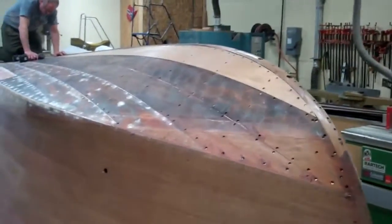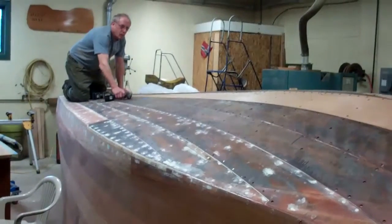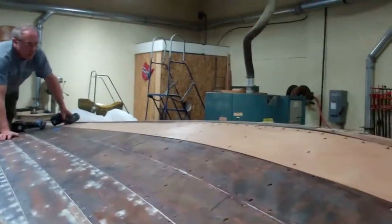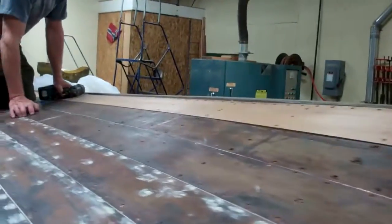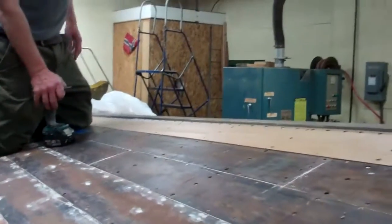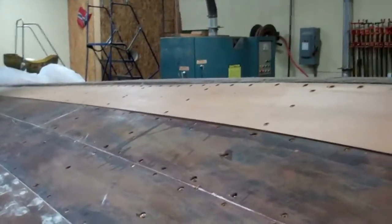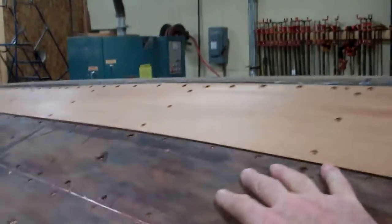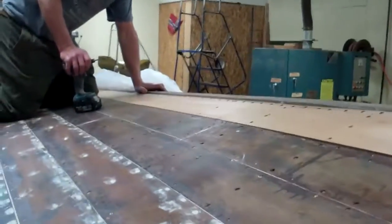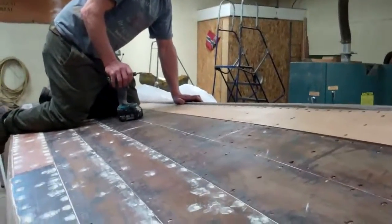We're working on the board we were looking for — the keel plank. If you'll remember from the previous clip, this plank was the forward section, which is joined right where John is, and was pretty beaten up, particularly right at the bow. We also faced the problem that when we installed the first five courses of planks, the space up here was wider than the original plank. I'll hand it off to John and he can bring you up to date on the 5200 bottom we are installing on the Shepard.